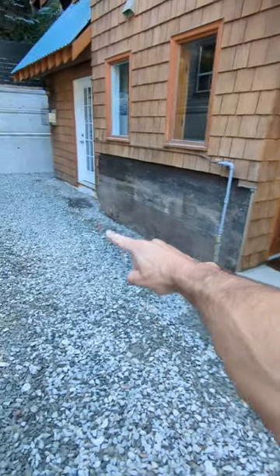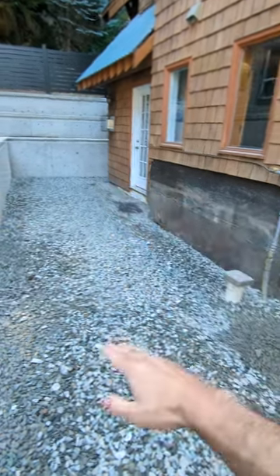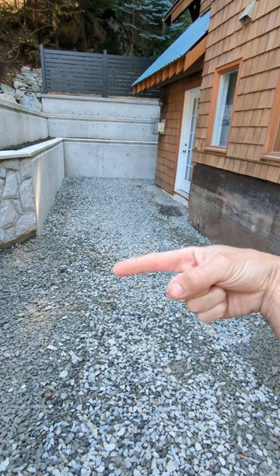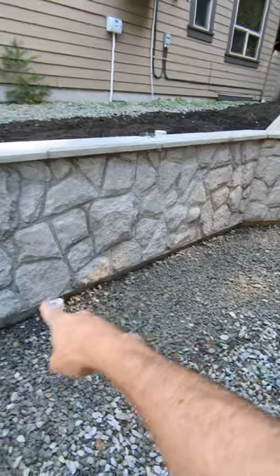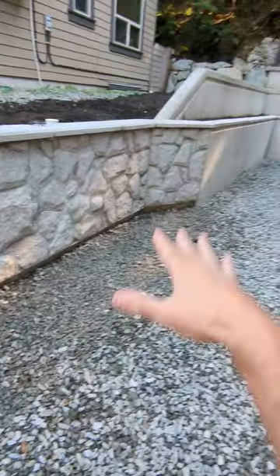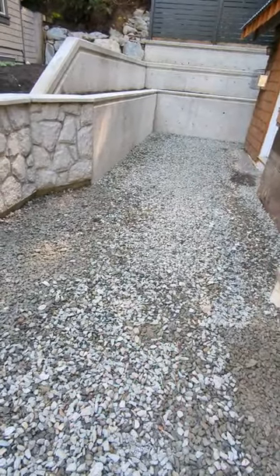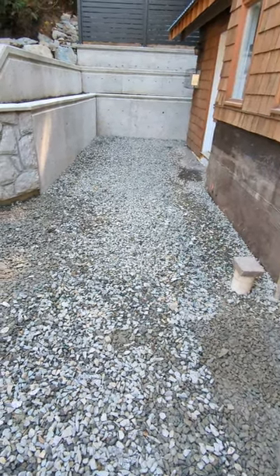We go from wherever that ends up at the five-inch stair, up to the top of concrete there — so we're kind of raising it there. From there we're pretty much level all the way around the house, under the siding, all the way to the back corner. Until this point we've got a 2% slope this way, which is what we based our angle iron on. We should hopefully end up a little bit below the angle iron. This is all pretty much drain rock, so probably best to get a bit of fabric on this before we put our bedding of three-eighths in here.